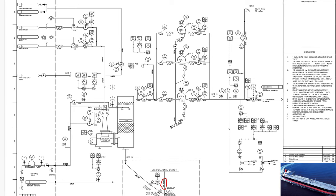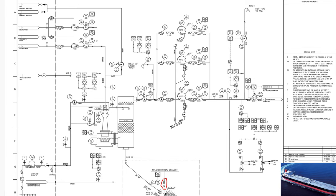The oxygen percentage that you can send inside the tanks must be less than 8%. If it is higher than 8%, your system will trip. Once below 8%, you can start to send gas inside the tanks. As you monitor the system working, you will see that your oxygen percentage slowly drops — if your system is working fine.